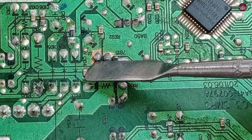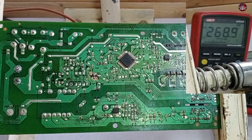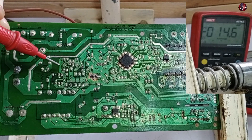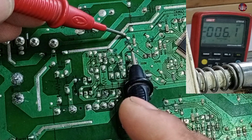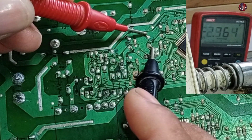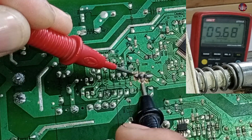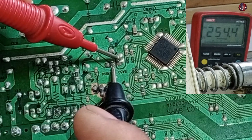After fixing the cracked pins, I passed electricity through the PCB board again. 312 DC volts are confirmed flowing through the IPM pins, which is fine. However, checking all the capacitors reveals the voltages are fluctuating on every one of them. As a result, this 15-volt regulator has fluctuating input and no output voltages. The same situation exists with the other regulator, which is likely why the LED light blinks.